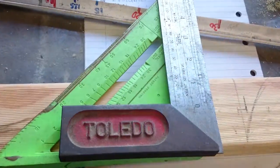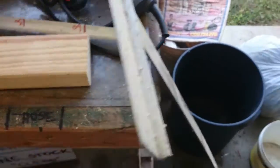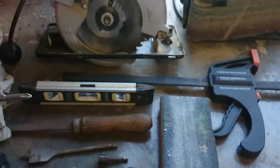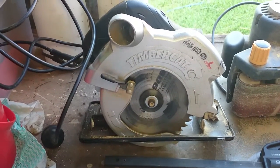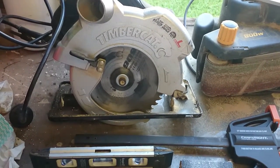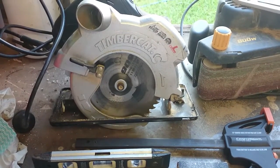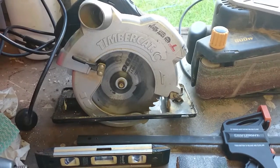Squares come in all sorts of shapes — you've got big long squares for laying out plywood. For cutting the actual ply, I use a circular saw. I wouldn't recommend using a hand saw; it's just too much work and I don't think you'll do it well or efficiently. But that's your decision. I've given you a video included in the series showing you how to use a circular saw to cut a straight line on a piece of ply.